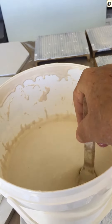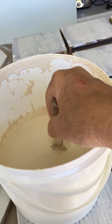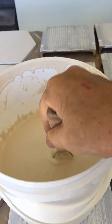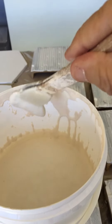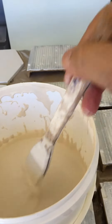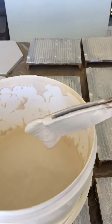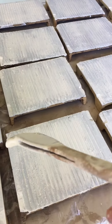If you just use the absolute bottom of your kiln to put some kaolin in, then you can make yourself up some calcined kaolin — or you can purchase it yourself. That is the consistency you can see I've got. See how it's running? That's the consistency I would use for doing the shells, and I would go like that, making sure it's not dripping too much, then just start applying it.